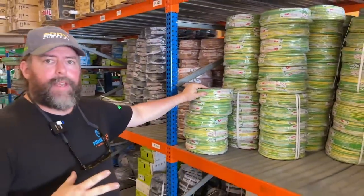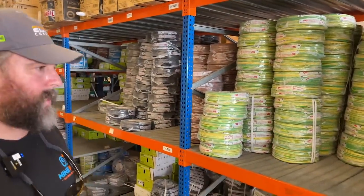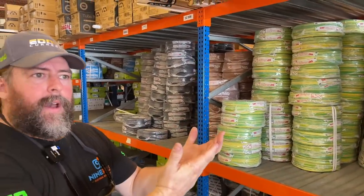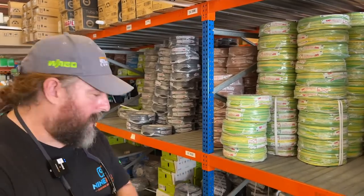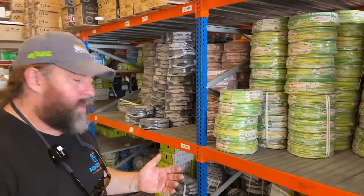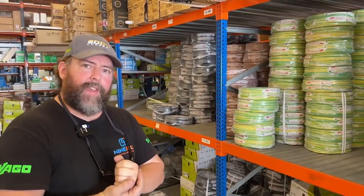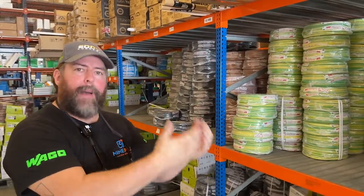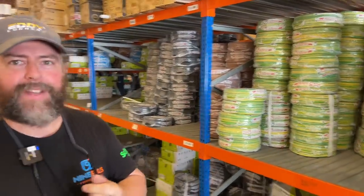That's the building regulations. That changed about the same four or five years ago in the UK. So everything that was done in 2007, 2008, and before really has to be rewired again, unless we can get the original certification from when it was passed before. Oh, well, good luck with that. Not kind of a retrospective authorization kind of thing.